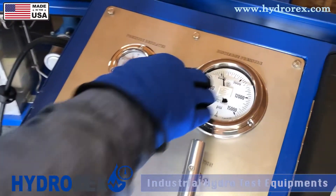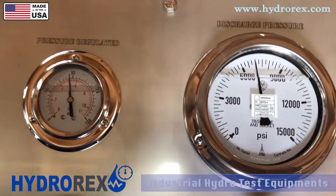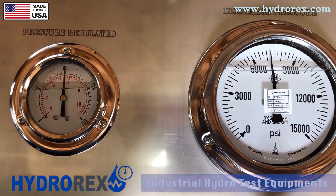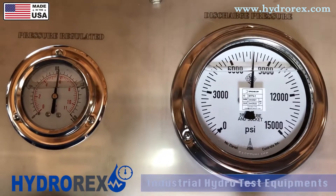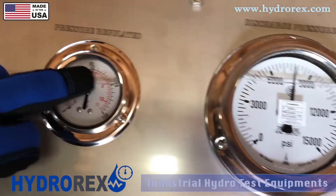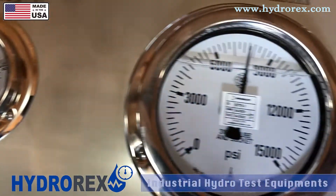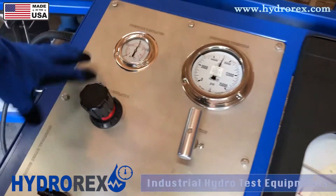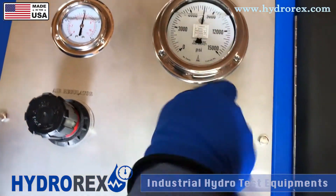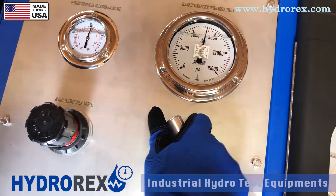After our 6000 psi step stabilization, we're going to bring it back up to 8000, which is our desired pressure, consuming at least 80 to 85 psi of air pressure. So we've reached our desired pressure now. Our next step is to close our isolation valve all the way shut.